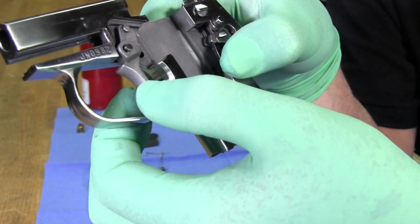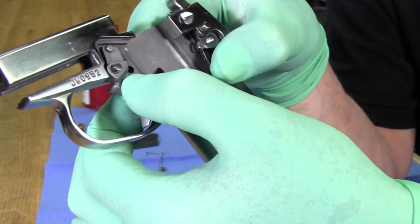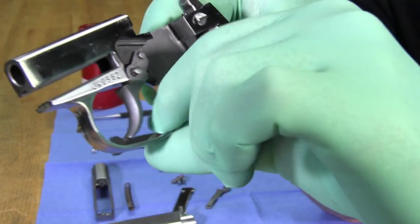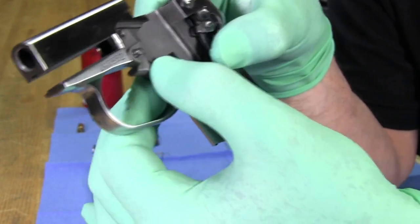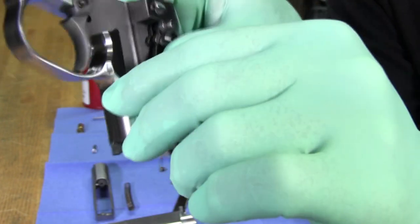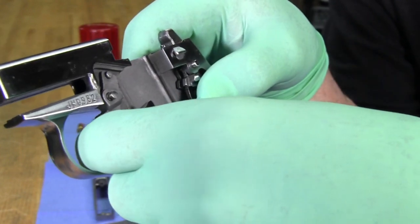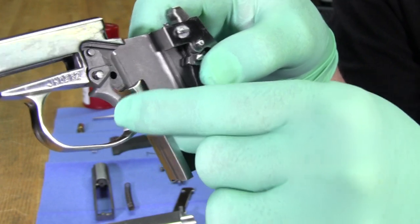The problem is, when it hit the guard, because there's so much lateral slop in the connection between the trigger and the pin, it would go to one side or the other of the trigger guard — because it's got a kind of roundish finish on it there. So it would go to one side or the other and bind up. It would still fire, because you had to pull it past where the contact point was on the bottom of the trigger to release the hammer. But because the trigger was too long, instead of just stopping, it went from one side to the other and jammed itself into the trigger guard.